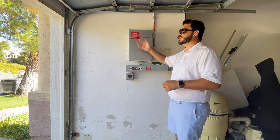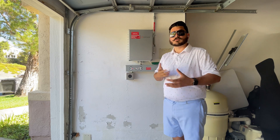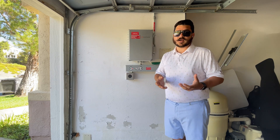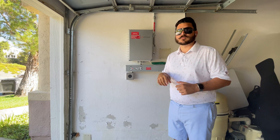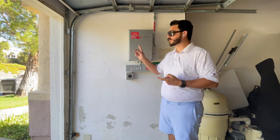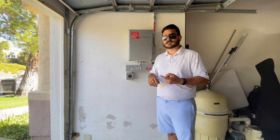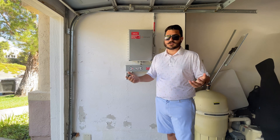With Enphase, you have a bunch of micro-inverters up on the roof, so you can't actually go and look at them. But believe it or not, there's actually a light on every single one of them that blinks depending on how it's working. Orange means it's producing power but just not communicating with the Envoy, which is inside the combiner box. Red means it's not working at all, and green means you're good to go.